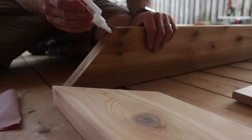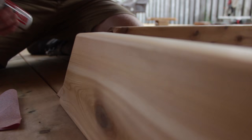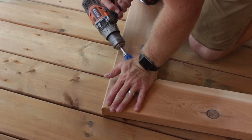I used two-part epoxy so that I didn't have to use any clamps to help me hold the pieces together before I screwed them. I then used a pocket hole jig and long screws to screw the corners all together.